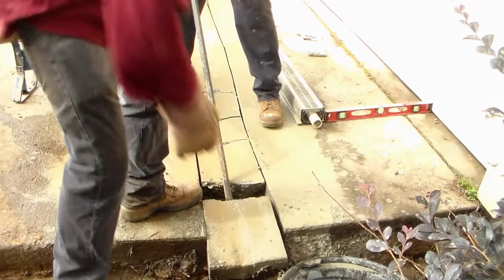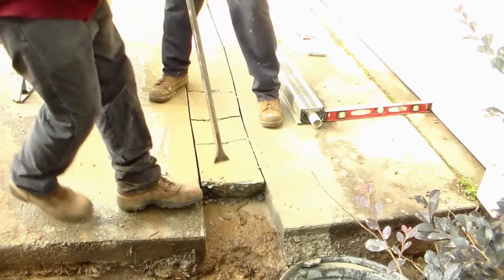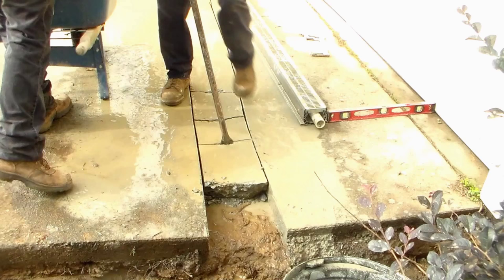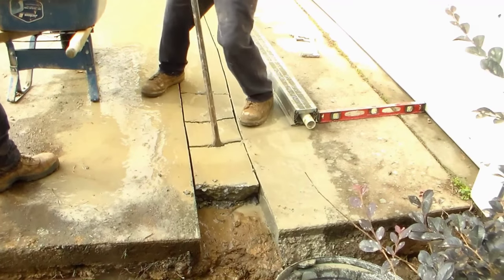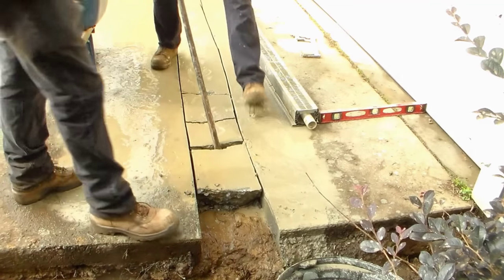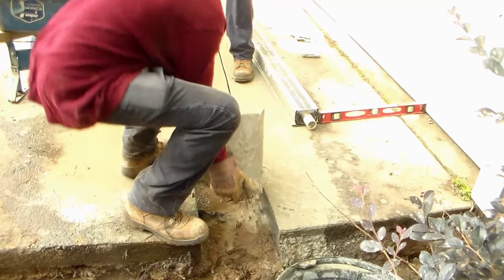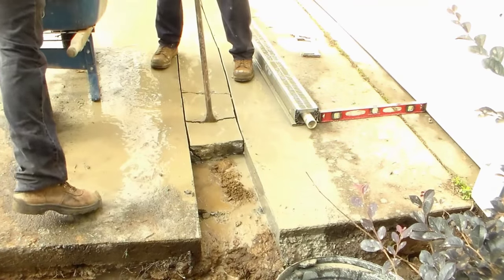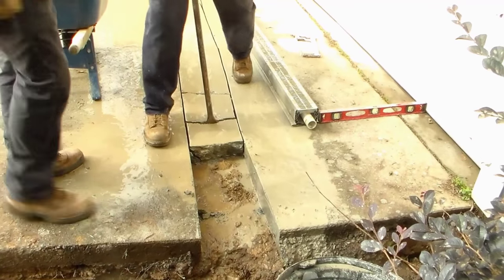We just pick that piece up. We try not to make them too heavy, but concrete is heavy. As you can see how quickly that cracked, just go down into it, Gerald. And you can hit, it's all right. And you just pry it up so you can get them out. Remember that the secret is to cut clear through the concrete, and then this becomes a fairly easy process. Pound down through it, Gerald.